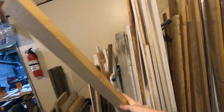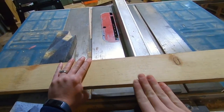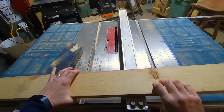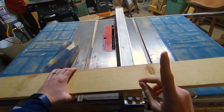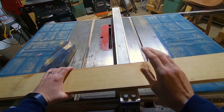Are we going to use the frame today? I picked up this one by four and I'm going to use it to create my frame by running it down the table saw, making one inch strips. Then I'm going to rabbit those pieces, and the inside pieces that I cut out from the rabbits I'm going to use for the inner frame. I'll put up the card for how I make rabbited frames if you need to see that for a better idea.